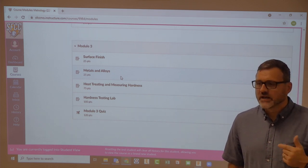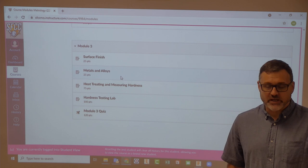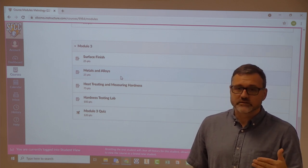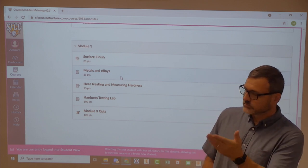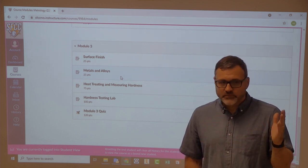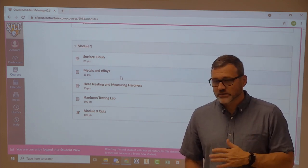So if I say, hey, this is supposed to be 55 Rockwell, I don't even have to tell you what it should be. Okay, C is the standard. If it's something different, if I say it's going to be 55 Rockwell A, which would be uncommon, then you'll know that it's something different. So if I say, Austin, turn all these parts to 35 Rockwell, or go use some material out there, some 52-100, some 41-40 prehard, make sure that it's 35. And so you would know that it's Rockwell C.